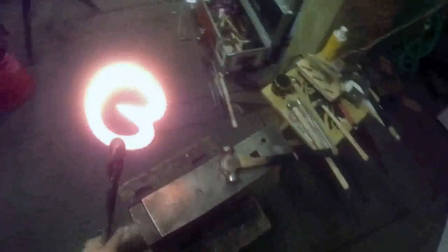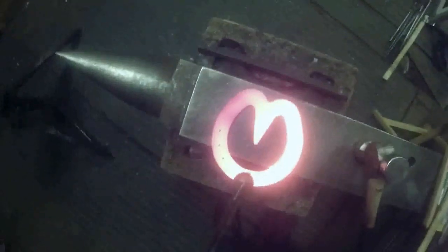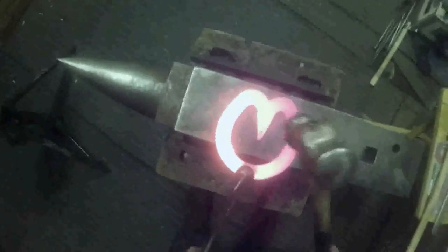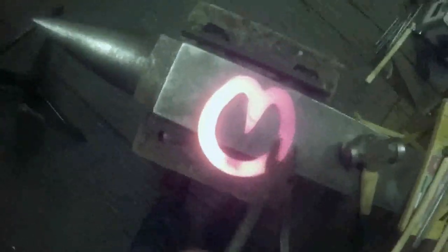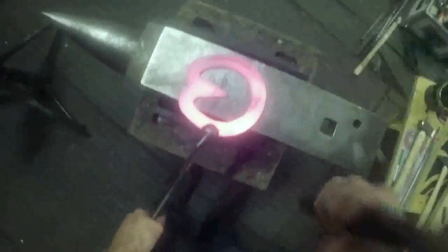And I'll run through the fullering, do the nail holes, job done. So this will be my last heat on this bar shoe now. So I'll give it a nice little clean up before I start. Move this frog plate over a tiny bit, just gently. I prefer hitting a bit of metal rather than putting the tongs in and moving it, but either way works. Force this brake over onto the toe.